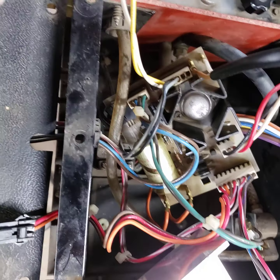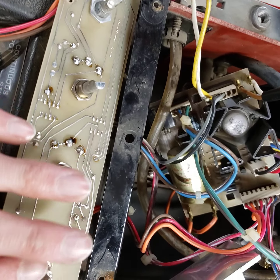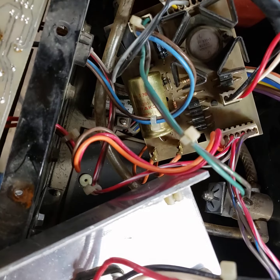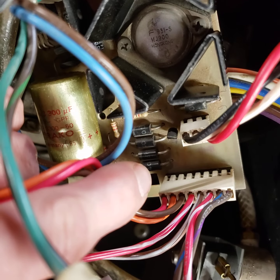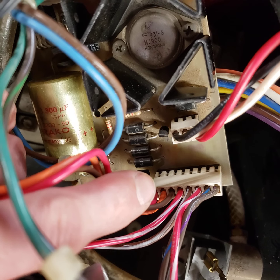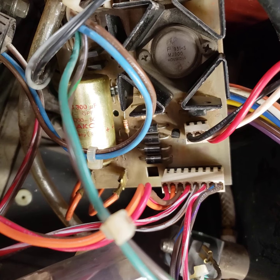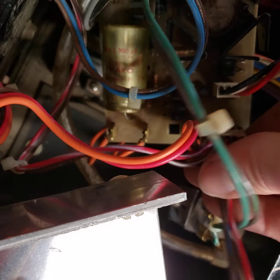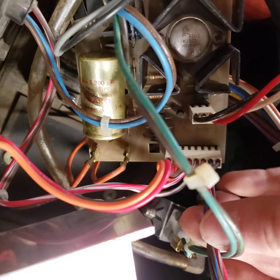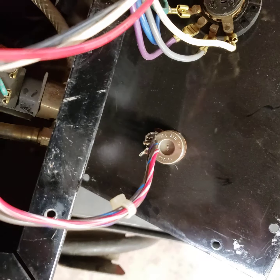Here's the selector switch — selector switch, three potentiometers. That hooks into three wires, which would be the last three pins on connector number one. The other thing on that connector — the first three pins — is the speed potentiometer, which adjusts the motor speed for the feed.